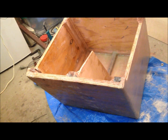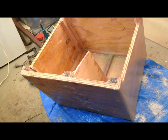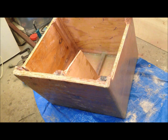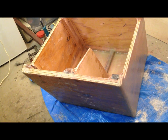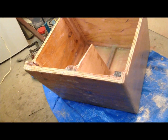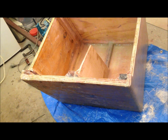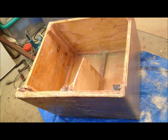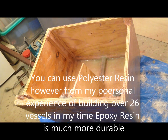Three 9mm laminated pieces of ply on the engine side. Basically, on the transom itself we have a very solid piece of timber — being laminated it makes it very durable. That's laminated with epoxy resin, not polyester. Polyester resin is not marine grade and it does have a tendency to shrink over time, so epoxy resin is by far the better choice.